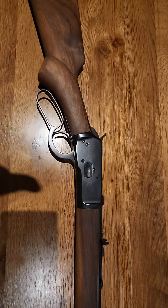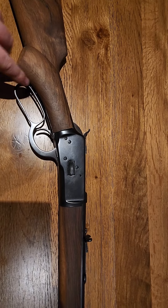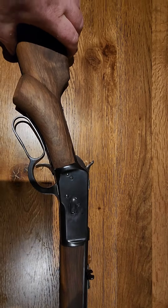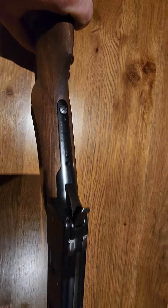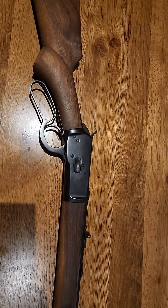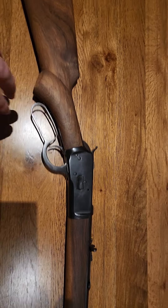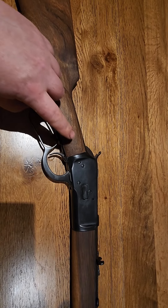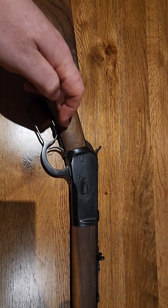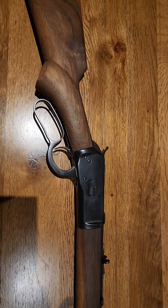I actually did the pistol grip conversion to this rifle, so the lower tang has been bent. There's been an angle drilled through the tang and re-threaded to take the brand new tang screw. Obviously I had to bend and reshape the lever. I also had to make an extended screw for the hammer spring — it comes out at a straight angle still, but there's a spacer and an extended screw so it operates at the same tension.